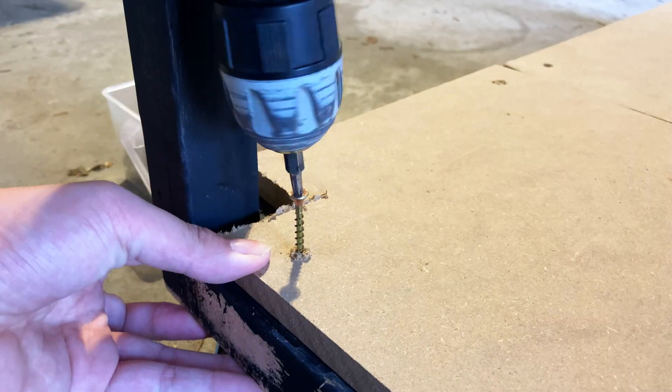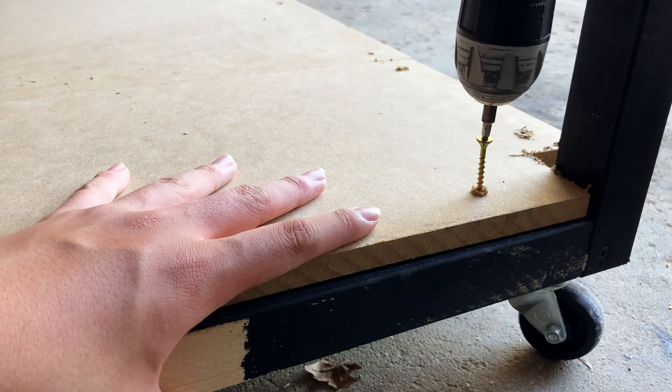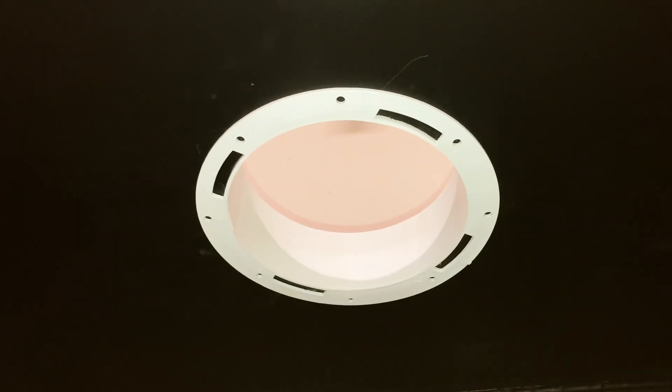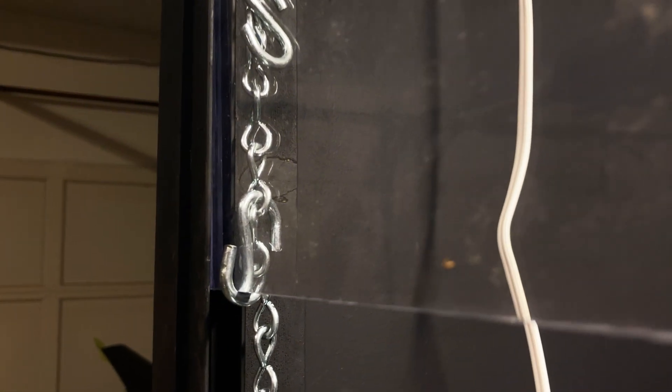Now the last step is to add on the boards for my bottom shelves, which I again screwed on. On the bottom shelf, I put into boxes my reagents like acids, bases, and oxidizing agents, as well as some alcohols. On the top, I have all of my glassware as well as tools. Moving back onto the top, my 300 CFM fan was then installed at the left, and all of the tubing connected. The tubing I used was 8 meters long, however it does have a metal-like coating — I think aluminum inside of it. Thus I might have to think twice about expelling vapors like bromine, which could react, or acids, which could corrode it. The last thing I added was an optional chain hook mechanism for keeping the sash in place, but I really don't think it was that mandatory because I did install some small nails that the board can latch onto the sides.